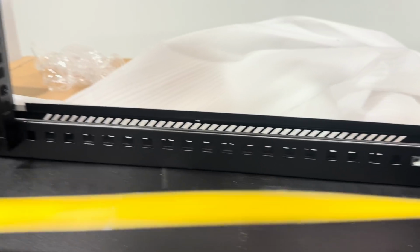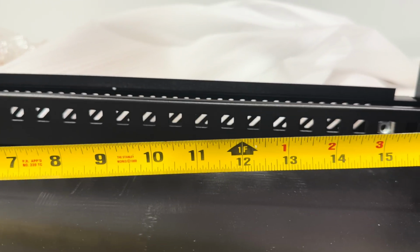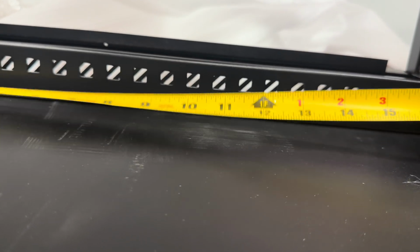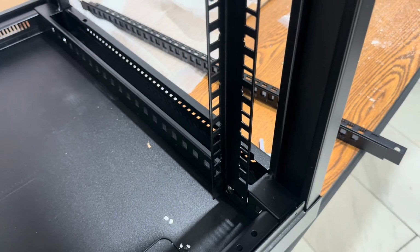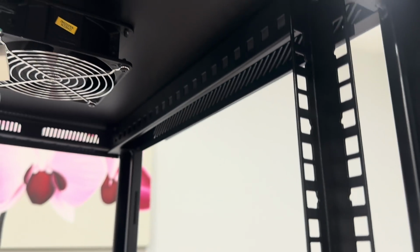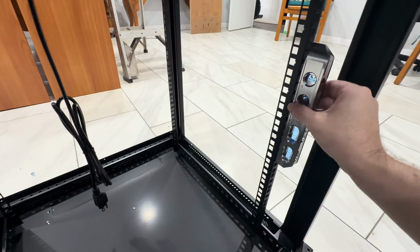I've screwed up a few of these racks in the past, so nowadays I make sure to measure so that the depth of my equipment is compatible with the door and the patch cords. You'd be shocked how often it is that you can't close the door because 48 patch cords refuse to bend.